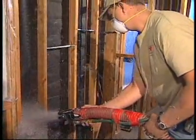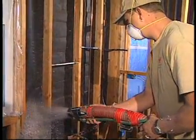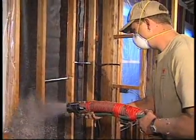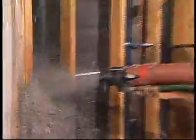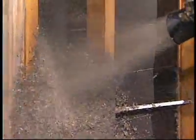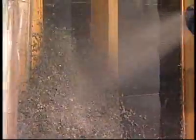Now what density should we be putting this in, and how do I know I've got enough insulation in the walls to make sure it's doing the job we want it to do? Well, the system's fairly immune to installation defects. If they put too much or too little water, it may not even stay in the cavity or it'll be too wet. So as they spray it in, the system is very good at applying the proper amount of moisture and density — because if it's sticking to the surface and not falling off, it's not too wet or too dry.